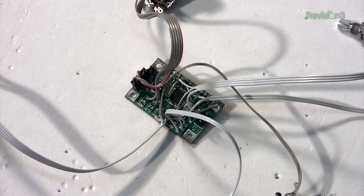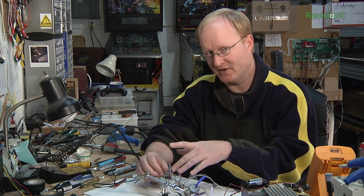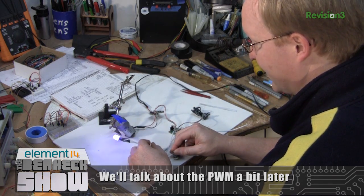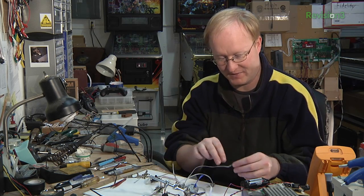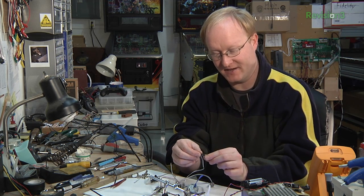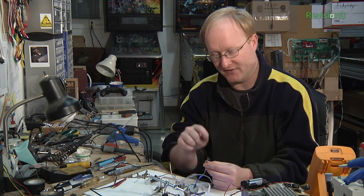We have my microcontroller package — a little AVR board I built, used in season three. Over here we have a motor driver that takes the 12 volts and drives the motor. We have to pulse the motor driver — the motor driver doesn't do the PWM, but the microcontroller can. This is our indicator LED that tells us if we're at temperature or heating up. And this is a very small solid state relay that's turned on or off via the microcontroller to pass AC current through the hot end.